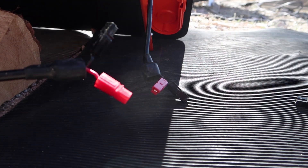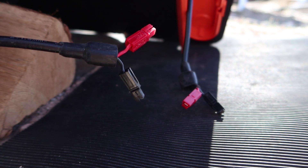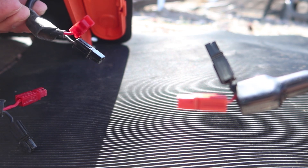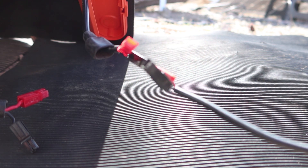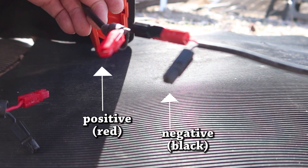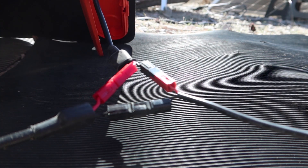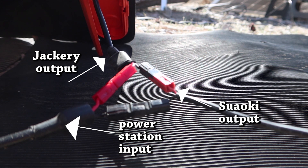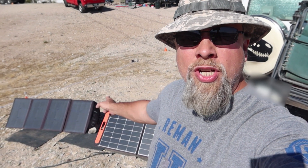You need to do the same thing with your extension cable. The important thing to remember is that the power pole going to your power station needs to be positive to positive and negative to negative — the outcome needs to be set up that way. So how do you actually connect these two together in series and do it properly? You connect the positive from one panel to the negative of the other panel — it doesn't matter which panel you do this to — as long as you connect negative to positive on one side, that leaves a positive and negative to connect to your extension cable. Then you literally hook positive to positive and negative to negative. You now have two solar panels in series without needing any special Y adapters or anything at all. That's the cool thing about Anderson power poles — they come apart. That allowed me to turn two 100 watt panels into one giant 200 watt panel.